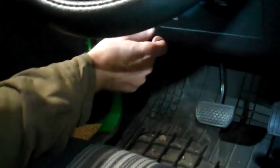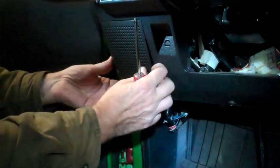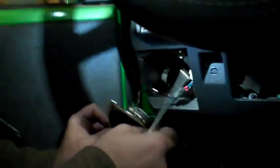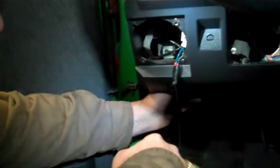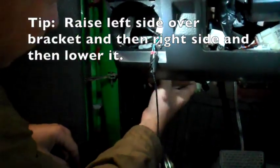First I'm going to take the battery cable off. I'm going to pull this little part out from under the steering wheel and take this speaker cover off. Now I have to take the speaker out. The computer is right back here, and below the computer is the fuse box — it's attached to part of the same unit. There are two size-ten bolts there. If I take those two out, the whole computer unit with all the attachments will come down. I got the two bolts out. Now I'm going to see if I can lower that computer down and put it under the dash where it's easier to work on.